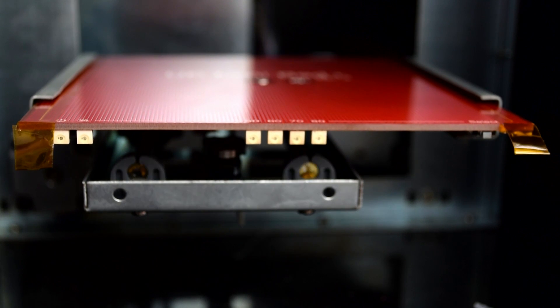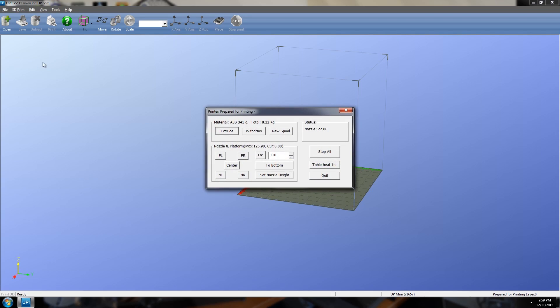That happens with the UP Minis — even if you transport them they can go out of alignment. So I did that and then I printed again. Controlling the version 2 heat bed is logical and easy. Start by preheating for one hour in the UP software so it has power, and simply cycle through the temperatures using the button. It can be a little tricky landing on the right one, but I got there. After selecting a temperature it will display its current temperature, which is really handy for knowing if your bed's hot enough. I waited till it was at 80 degrees and stable, then sent the Warpenator 5000 to print again.